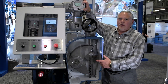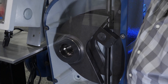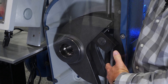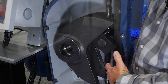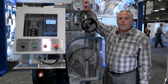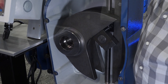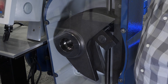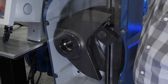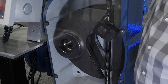As you see here, we have a yoke nut on the motor stem. The motor is now running to the open position. The crescent moon, which is the yoke assembly, is attached to the valve shaft, which is in turn attached to the valve disc. That was a sequence of moving the valve to the open position. Now we'll move it to the closed position. You see the motor stem moving in an upward direction, pushing on the yoke nut which rotates the shaft. The shaft is connected to the disc and now the disc is closing slowly against a running pump to minimize surges on pump shutdown.